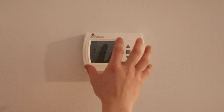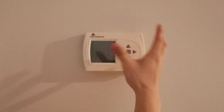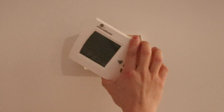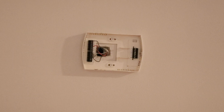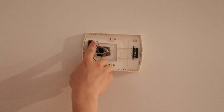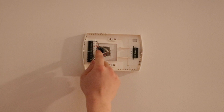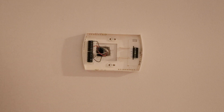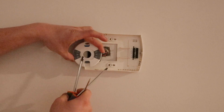Let's go ahead and install this thermostat. It should be pretty easy. This is our regular thermostat — Climate Master. The first thing we're going to do is pop off the display. Now we're going to take a look at these wires. You'll notice on the side they have these letters. We're going to take a note of which one goes to which letter, and we're just going to hook it up the same way as it is on our thermostat here.